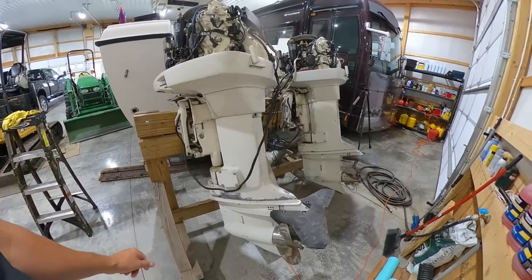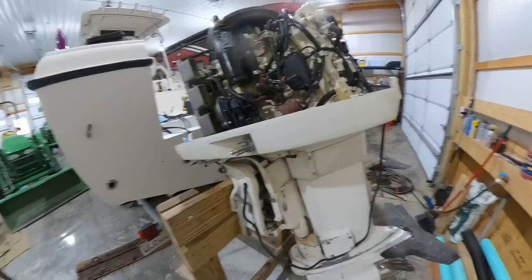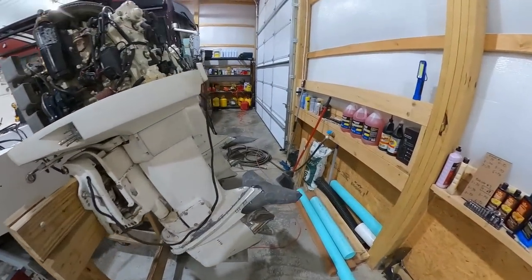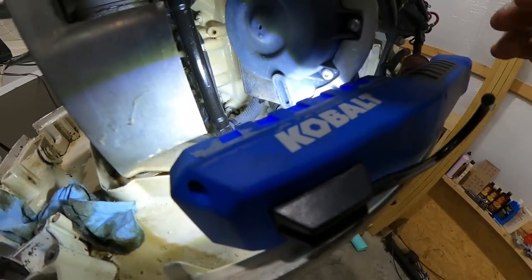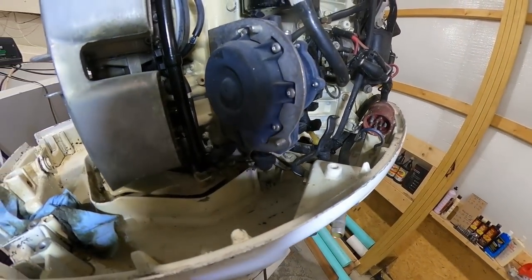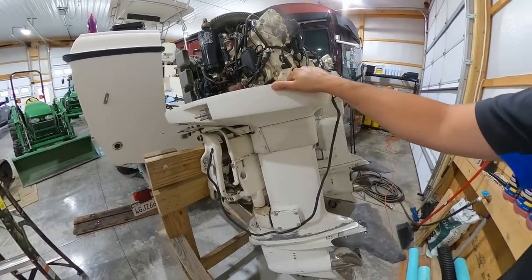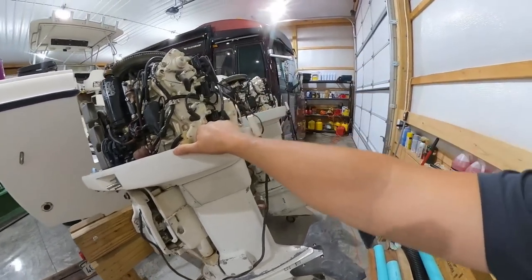If I can get them running, maybe I'll look into rebuilding them — rebuild kits are about $1,200 for them. I want to see if they're going to run first, and I also want to run them and then check the compression. This thing's been sitting in the same exact location for a long long time and it may just take a little bit of wear to get the compression back up. Before I run them though, I want to change the impellers because I don't want them overheating. I have the impeller kits already, so I'm thinking about dropping the lower ends and doing that. There is a bolt way up underneath there that's hard to see that you have to take out. This VRO system is right in the way of that.